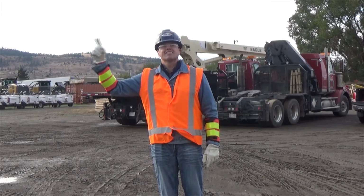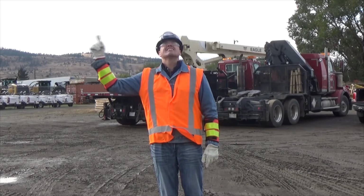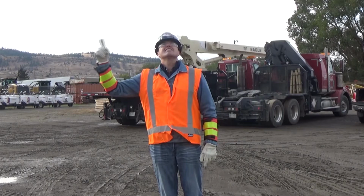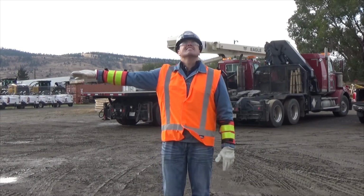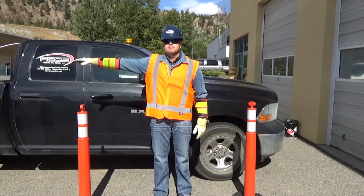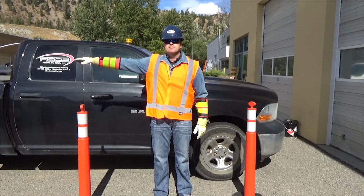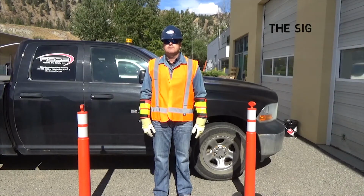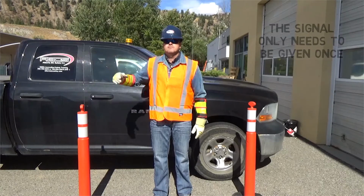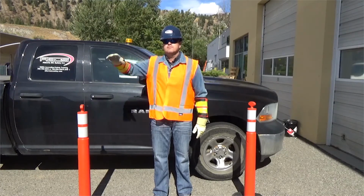In order to reduce or eliminate confusion between you and the crane operator, make sure that signals are given in a consistent manner. The stop signal should be given at the end of each function before moving to the next movement. Before proceeding to the next signal, verify the load is hanging freely below the hook and not swinging. The crane operator must not respond to signals that are unclear.